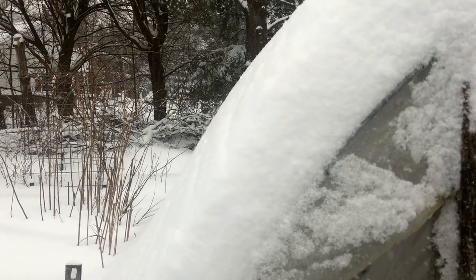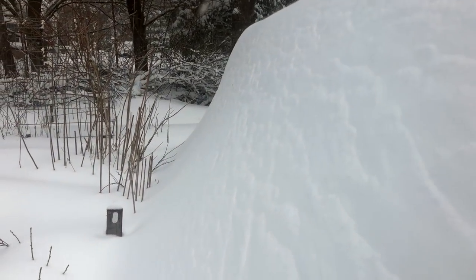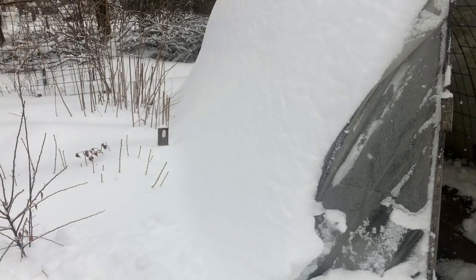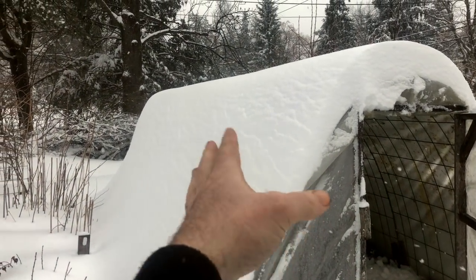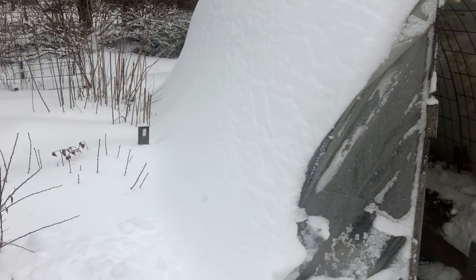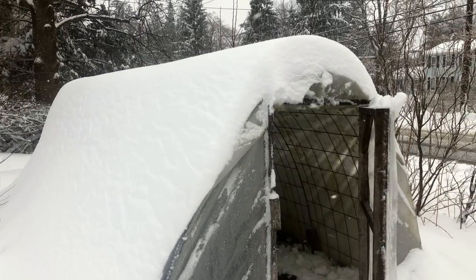On the outside you can see snow that definitely clings to the side, but it really does want to dump down to the bottom. If we had 12 inches of snow or more I'd almost certainly be out here with a snow shovel taking material away from the side. I wouldn't go along the panel trying to remove snow directly — that's asking for rips — but if I can take away the material at the bottom it can shed more. Under a foot of snow, even with heavy winds, we don't have to get stressed out about it.